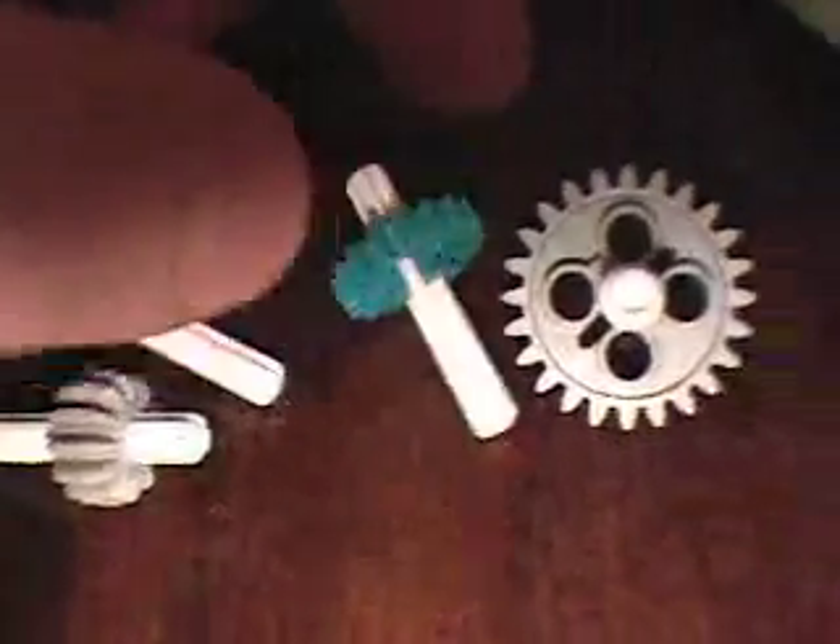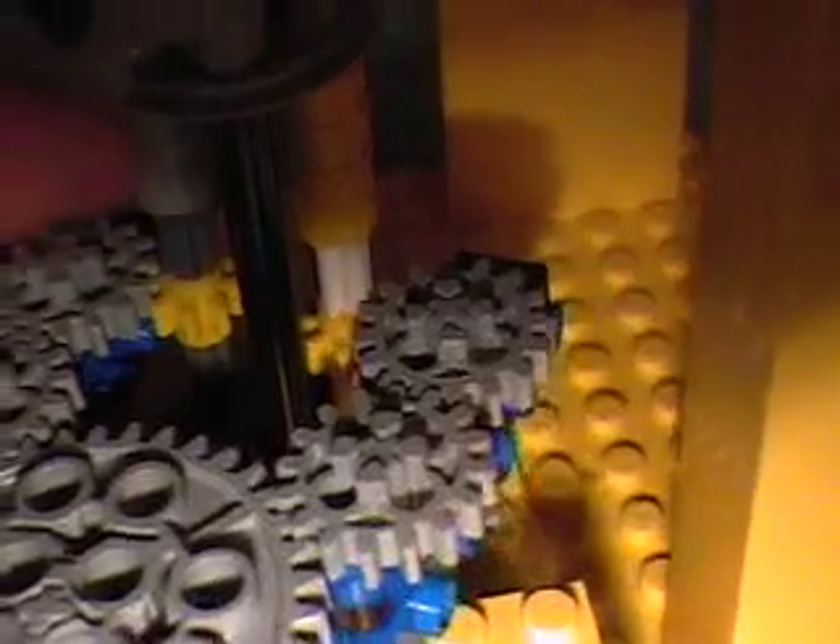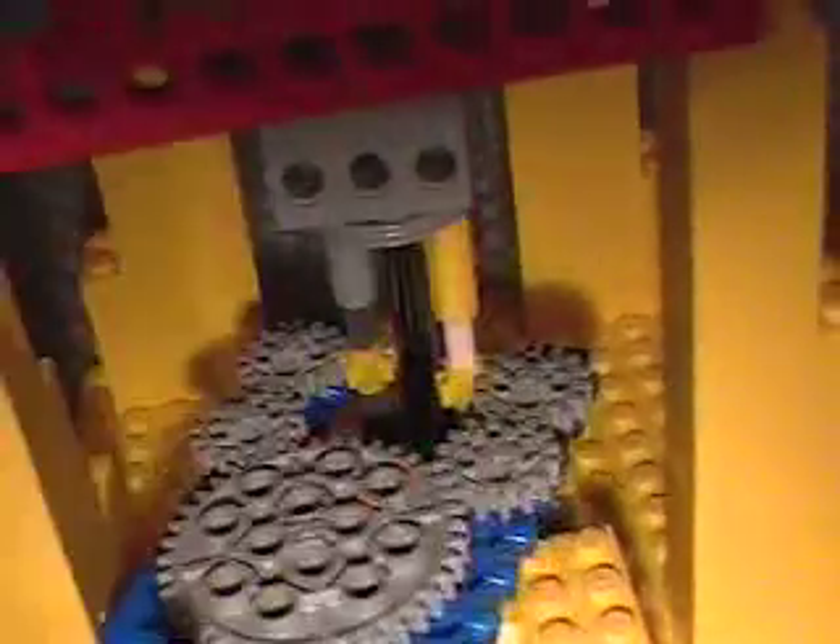Here are some of the gears available from Lego: you've got the 8, the 12, 16, and 24. If you want to drive this from the 8-tooth gear, you put it here; the 16 goes here. If you want to use the 12, that would go here. The 24 goes one stud farther away than where the 8 was. This needs to be positioned so that you're neither pushing the two small gears away nor pulling them towards you, but there's a balance — pushing one away and pulling the other towards you in equal amounts.